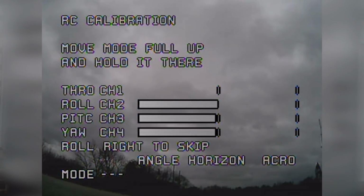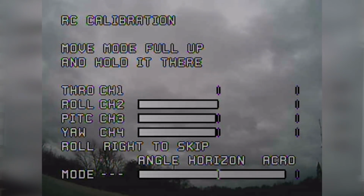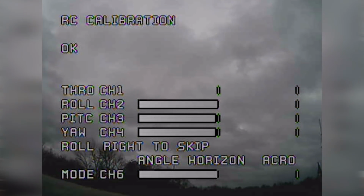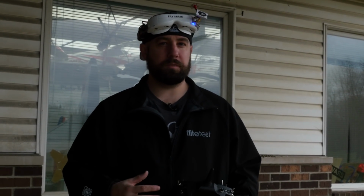All right, now it says move the mode all the way up. So our mode switch is D. Go all the way up. And move it to the middle. And move it down. And it says calibration is now complete. All right, now that we've done our calibrations, we kind of went through the menus a little bit. If you want to do more of the menu system or learn more about it, there'll be a link in the description that'll give you all that information.